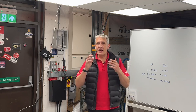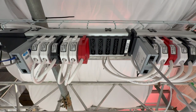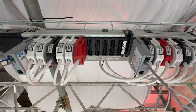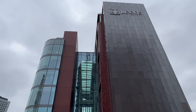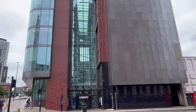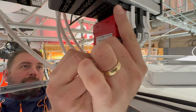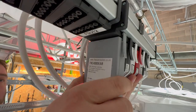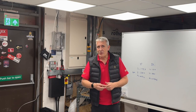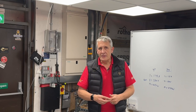It has however enabled us to demonstrate why using lighting distribution modules and pre-wired cables is such an effective solution for commercial buildings. It allows you to complete and test all of the fixed electrical wiring and then return to site and plug in all of the lights once the ceiling fitters have finished. And of course, the customer has finally decided the exact location of the lights. If the customer wants to change the layout or add additional lights, it's a simple plug-in installation.